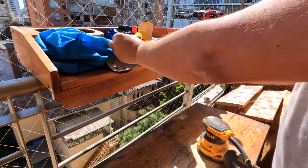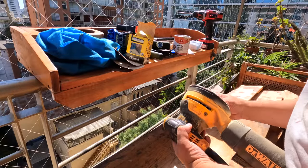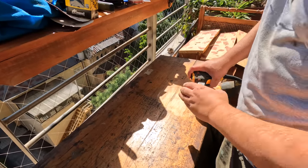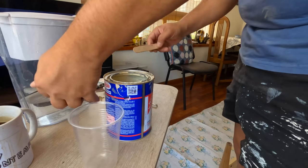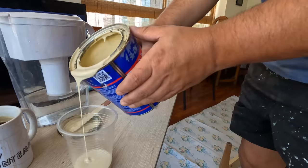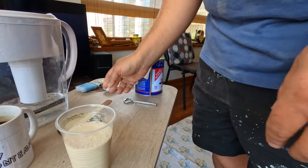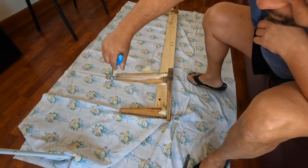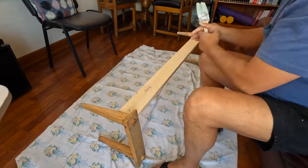For the top I used the same sanding progression: 60 grit to get rid of the dirt, 120 to sand slowly, 180 grit to smooth the surface, and 240 to make it velvety smooth. Here I am preparing my wash — I'm going to use a clear beige paint and water in a 30-70% ratio. The idea is to apply the wash as a stain and then wipe it away with a lint-free cloth; in this case I'm using an old t-shirt.